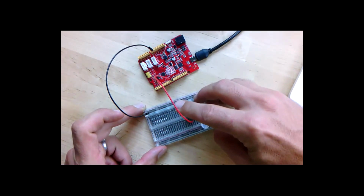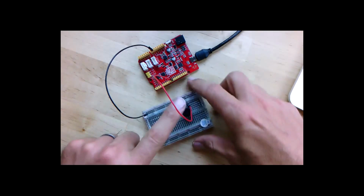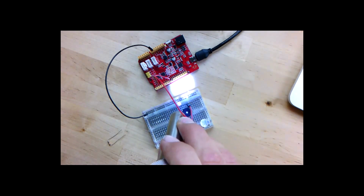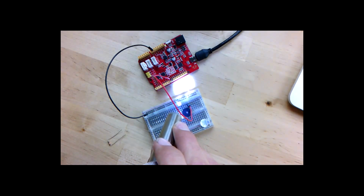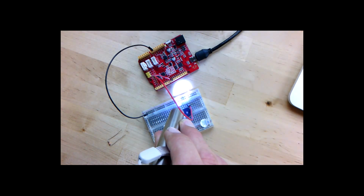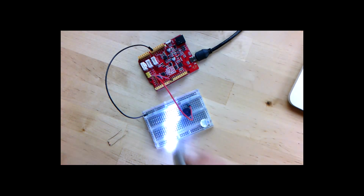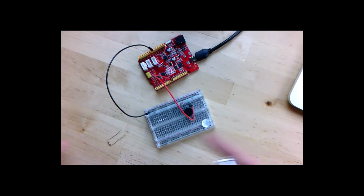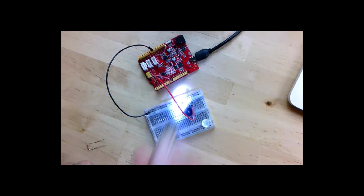If I get on the right, it's kind of hard to hear. And I think actually if I give it, okay. So can you hear it going up? When I put light over that photoresistor, it gets louder and softer. So what do we think is happening there? So when the photoresistor gets light, its resistance is lowered, and so we're getting more power to the volume, which is making that louder. So kind of a fun little thing we can play with there.